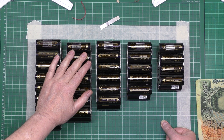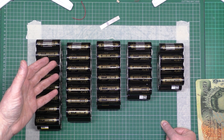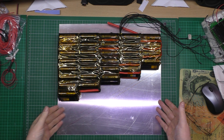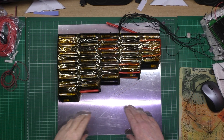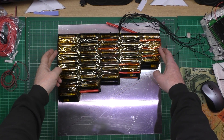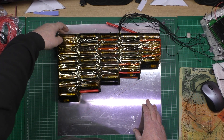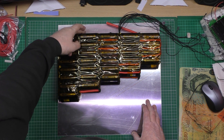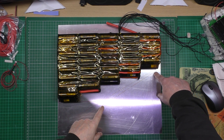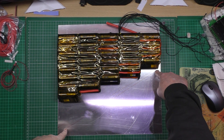This is actually holding me back from doing everything else - I've got to get the layout of where the battery's going before I do any other part. This is the battery mounting plate. This is the right hand battery - there's the front, there's the back. The pedal clearance is fine, it's not going to catch at all - it fits perfectly. There's a line up here which is where the battery goes to the top. This piece here is going to be bent over 90 degrees, and at the bottom it's going to be cut on this bottom line here. These lines are only for my reference. This is going to be cut here with a Stanley knife.